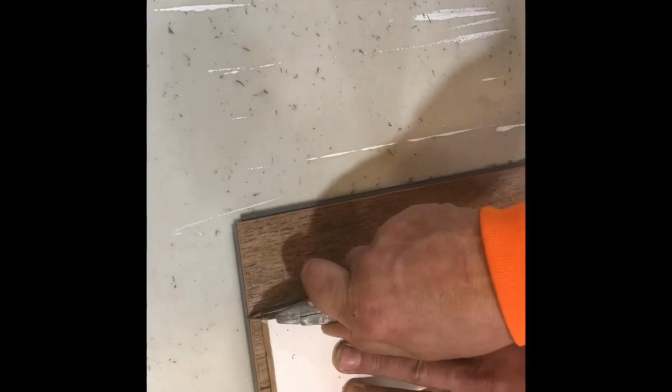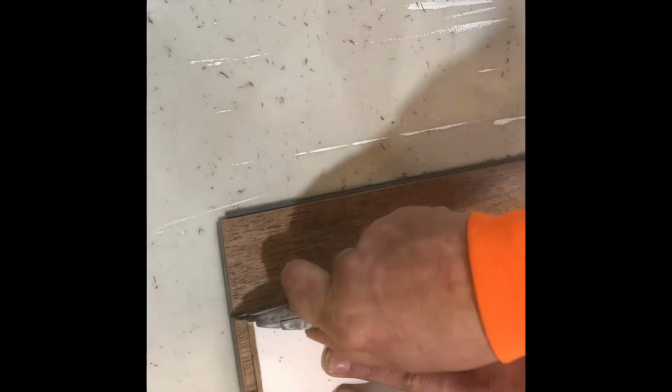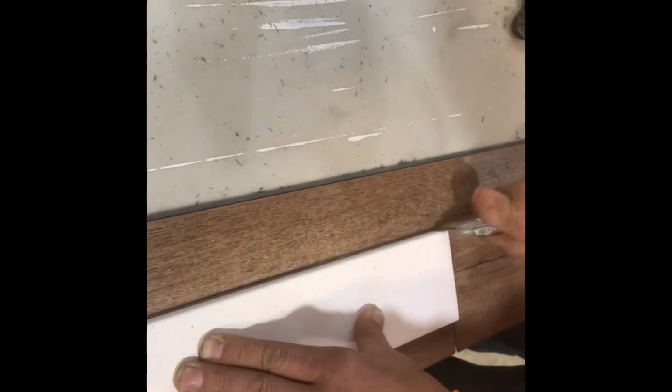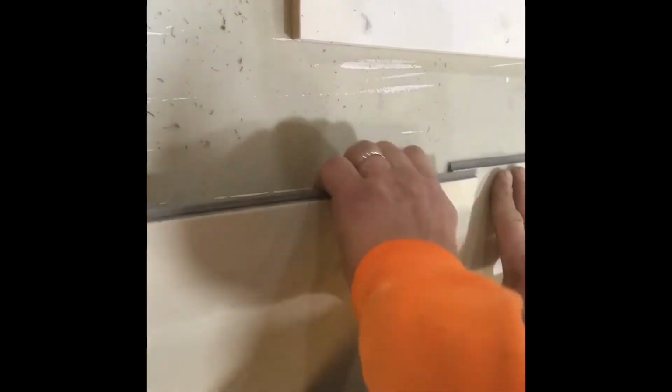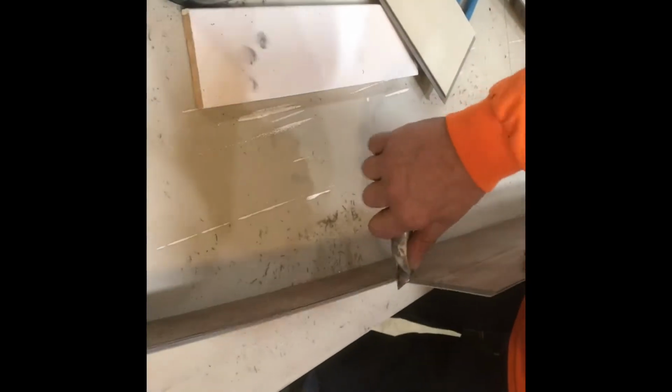You have to carry the board out to the garage or outside or something to keep it out of the house. But if you just run your saw up to your spots, if you're making two cuts in at least two different directions, you only have to cut one, and then you can use a razor knife. And after you've run the razor knife 2 or 3 times across your line, then you just snap the piece out, and then take your razor knife and just slice the back. That simple. You want to clean out the corners because your saw doesn't go all the way up into the corners. Just makes it so much easier.